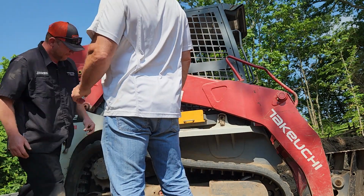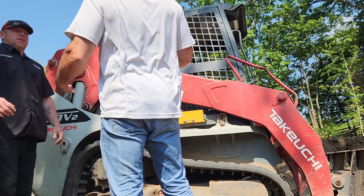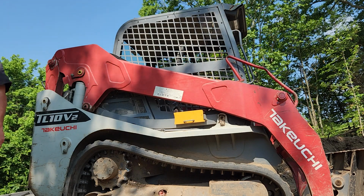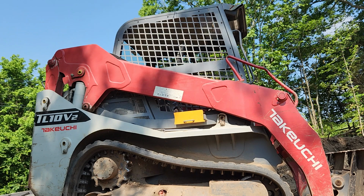What kind of grease should I use in this? It doesn't matter. Multi-purpose. Okay. Most greases you buy. I bought 2 big grease guns. This is what we run, a Napa general purpose. It ain't gonna hurt it because you're not doing wheel bearings with this. All you do is hold tension against the track adjuster.